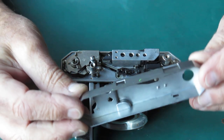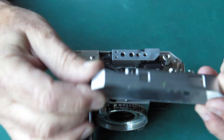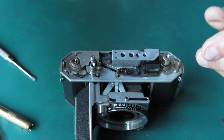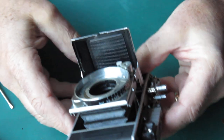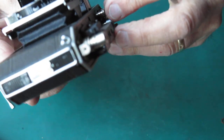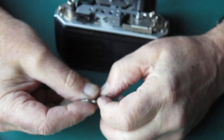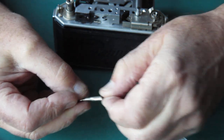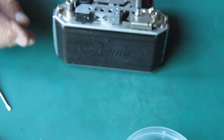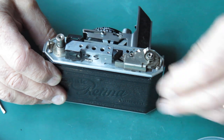Top cover — the glass is a bit grubby, nothing else particularly obvious about that. The shutter release — I'm looking to see if there's a spacer washer in here, because often there is. If you're aware of its presence then you can be looking for it. No, there isn't one in this case — because if there was one and you lose it, things don't work well. I'll separate those parts off, put the spring to one side, take off the film release button, put its spring to one side.